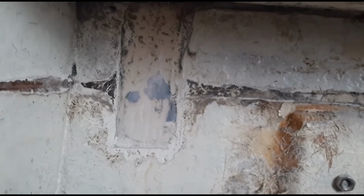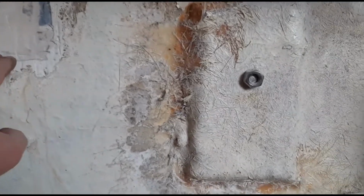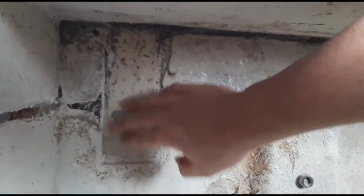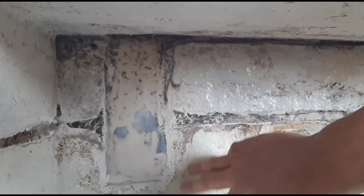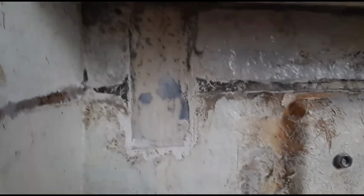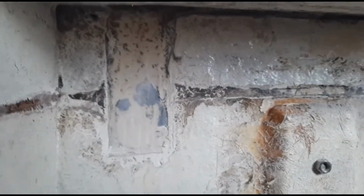So this is the first one, sort of tidied up area. My new backers are going to come back down to about there, I think, so I might need to just clear that out a little bit more. There's the fiberglass and the polyester from the original mould, and then they've just laid it up with glass. That looks thick enough. There was some polyester sort of like glue which I'd used to stick this down with. That was quite hard to get off, but obviously needs to be a decent surface.